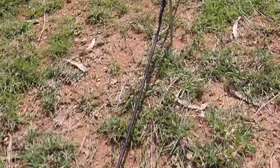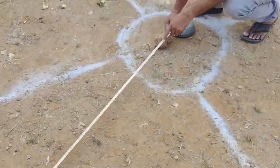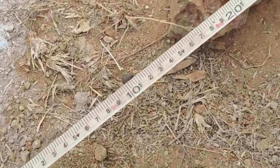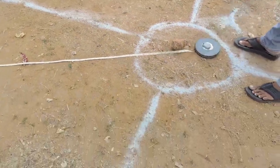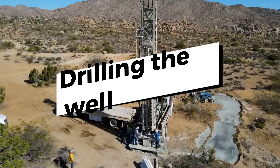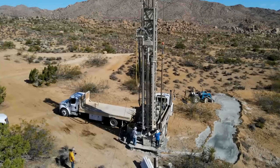If there is not an adequate water supply or the correct directional flow of water, you may need to select a different site. Evaluating the site is an important step for determining the desired depth of the well, understanding the rock formations present, and selecting the correct drill bits needed. Drilling the well itself involves setting up the drilling rig, drilling the borehole, and installing the casing and screen.